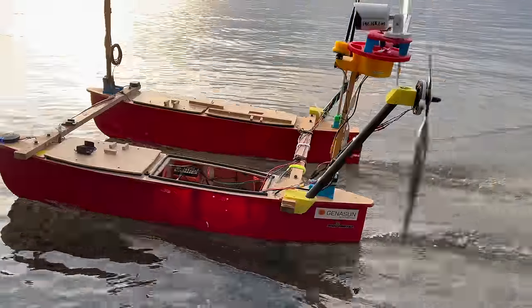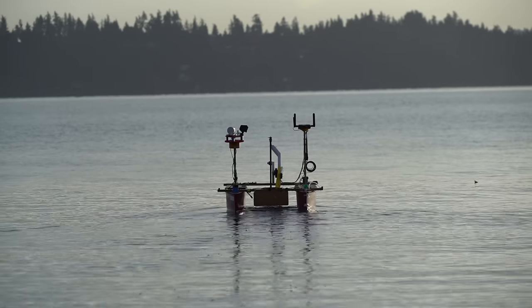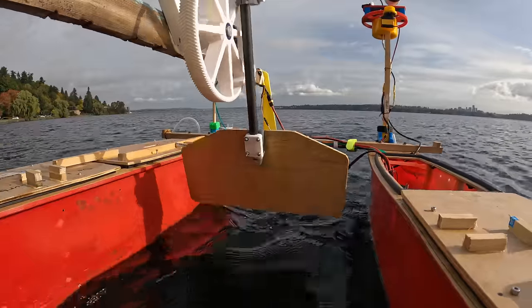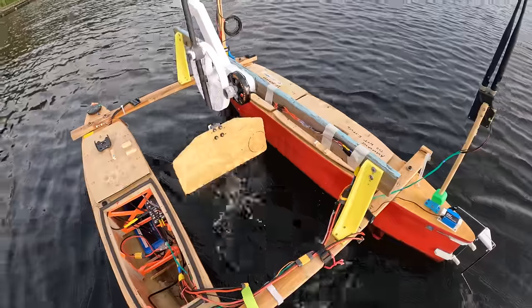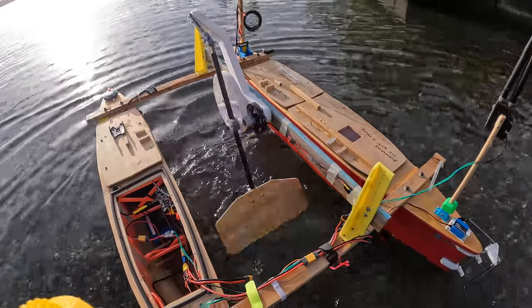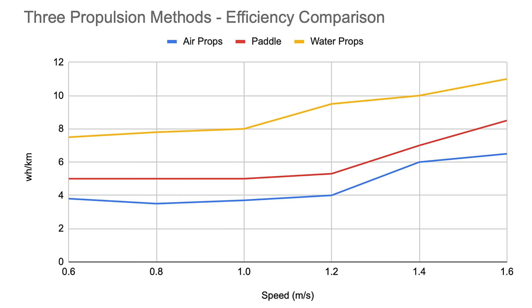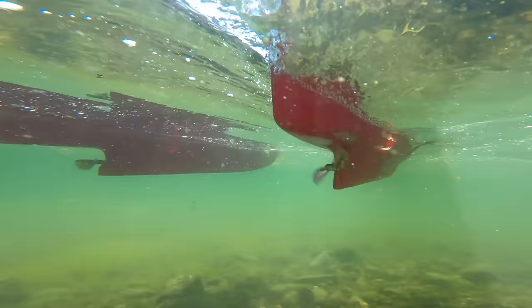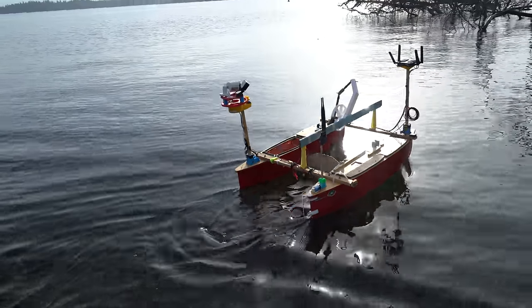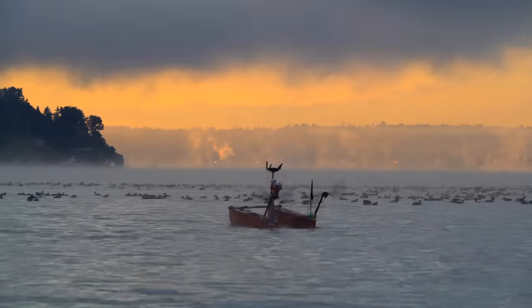Double the motors also means double fast — it got up to 4 meters per second this time. So finally, the moment we've all been waiting for, it's time to compare the efficiency data. The paddle was most efficient at its highest mounting position, and at this position the pivoting paddle wasn't really doing that much. The data shows that a rigid mounted paddle was maybe like 10% more efficient than the pivoting paddle, but that difference could just be in the noise. As for the air propellers, the dual propellers were notably more efficient than the single propeller. The water propellers just have so much less disc area than the air propellers and the paddle. Also, the water propellers have to transfer power through long shafts and stuffing boxes to keep the water from leaking into the hulls — with the air propellers, we ditch all that inefficiency.